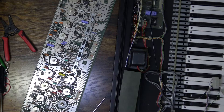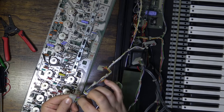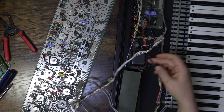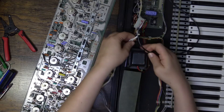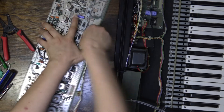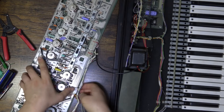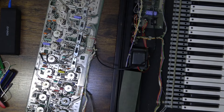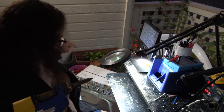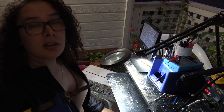I've got a nice freshly soldered power line here. It's maybe not in the best shape, but I don't think it's going to harm anything. Now the challenge is: can I get this all connected with the current cable lengths I have? I really don't have a lot of leeway. That's looking plugged in. I've got my HAKKO desoldering gun, and I'm going to desolder a leg of each of the electrolytic capacitors on here and test them out of circuit to get an accurate result and see if any are bad.